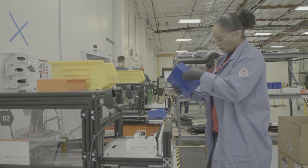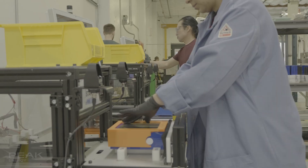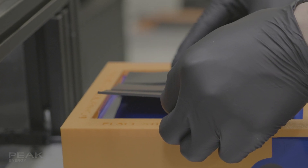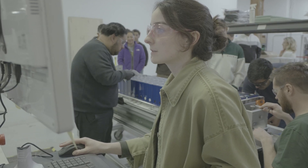I'm Adriana Raffin, I'm the process engineer here at PEAK. This is the first step of our flow. What happens here is we decant all of our cells from their box. They come in from incoming inspection, we place them in the cell test drawer, and then once the battery comes out we do our foam placement. The foam placement essentially sets the battery up for the next step of the process, which is our stack process.